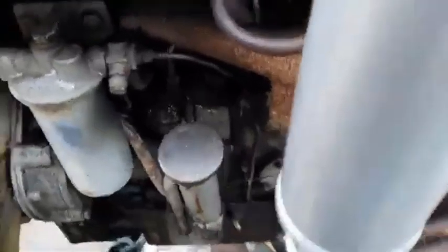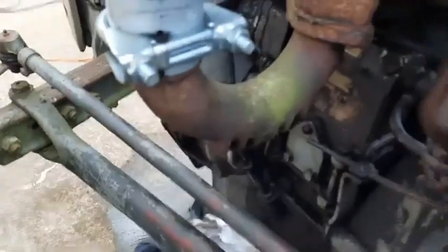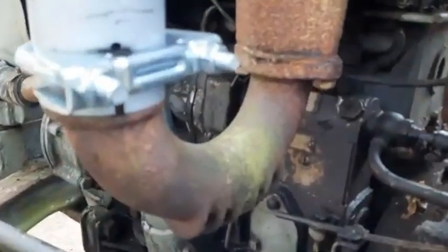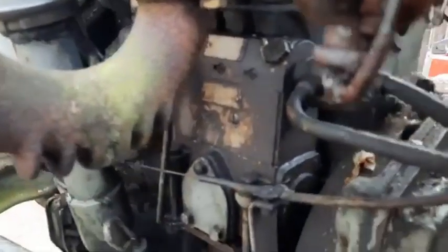So we've got the fuel pump. What about getting that fuel into the cylinders? Well, that's where the atomizers come in. The atomizers? Essentially the nozzles that spray the fuel into the combustion chambers. Gotcha. The manual actually provides a really handy chart that lists the different atomizer codes and their corresponding pressure settings. So again, making it clear that you had to choose the right atomizer for your specific engine. Absolutely. The wrong atomizer could lead to poor combustion, reduced power, even increased emissions. It's all about getting the right mix of fuel and air. Exactly. It's a delicate balance.